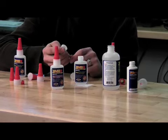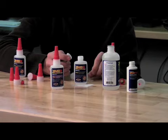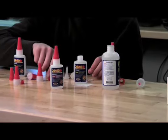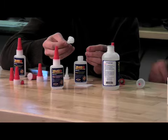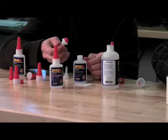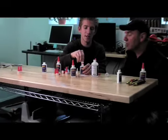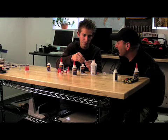The pin would have to look like this, and another thing that would happen is this foam seal would no longer be there. So once this seal would be broken, there'd be no more seal protecting it. The other idea we had was to mold this red cap over the lid itself — create a customized one that fit over the top of that, thereby making a seal. We would have a little customized seal. But we noticed that wouldn't work because it was way too thick still, too tight. So we'd have to change the mold on the main tip again, and that would be very, very expensive.